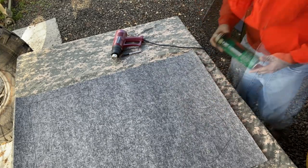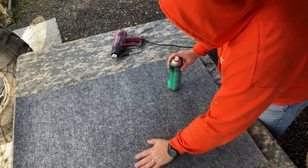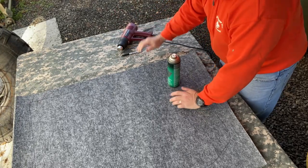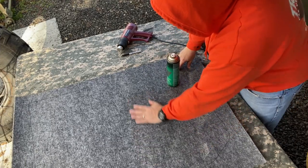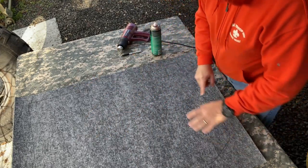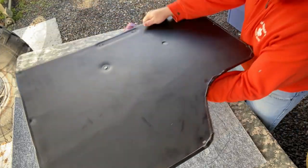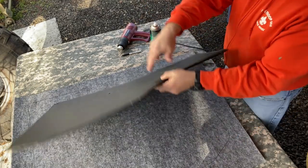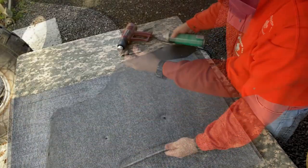Take your pen or Sharpie and mark all around it. You can kind of see this line. Because this is contact adhesive, it's got to dry just a little bit, so I brought my heat gun out here because it's a very cold and very humid day and it might have a little issue drying. I'm going to spray this area, also spray this area, wait for the glue to dry just a little bit, and then it's going to go plop just like this.